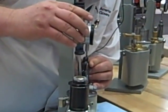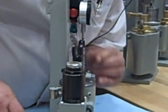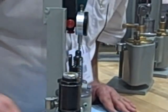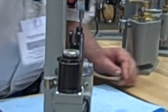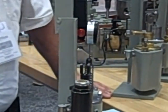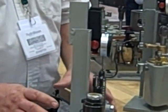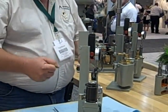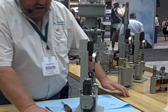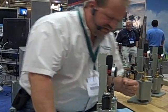Here's 100 thousandths, there's 150. I'm going to close the needle and release the dashpot. When we cross 50 here, we start the timer — my stopwatch. We're measuring the first 100 thousandths of a return; one rotation is 100 thousandths. If that time is at least 30 seconds, we know the dashpot clearances are still good and it has enough dampening action to control any hydroturbine. We've already got almost 30 seconds and we're only at 50 thousandths return.